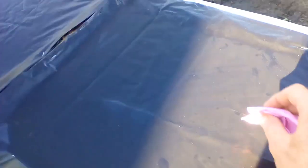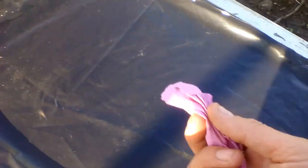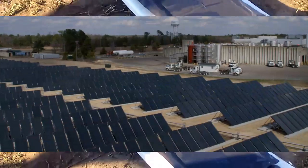I covered both containers with a black film, and now we observe the dew which appeared on the film above the first (cold) water during 2 hours. This is very important, because I have a hypothesis that morning dew is the main cause of dirt on our black surface, as it collects dust from the air. The film over the second (warm) water has no dew. Thus, if warm water circulates through the heaters starting from 3 or 5 o'clock in the morning, we will not receive morning dew and our heaters will remain clean — this solution can be easily implemented for large solar stations.